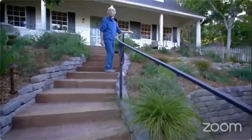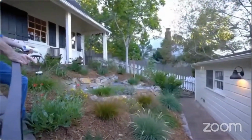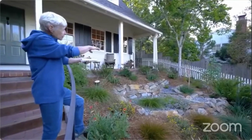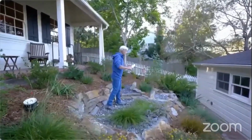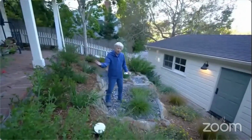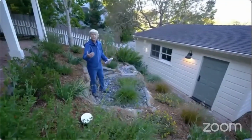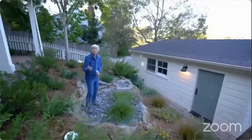So right here we have our first wetlands. And as you can see, this hillside is quite steep. So we have to be careful here because we don't want any overflow of the wetlands to come down this hillside. So what we did is we brought the water into the wetlands and capture the water back, but then as it fills, it then is set up to overflow in this direction. Rather than having it flowing down the hillside, we've broken the extreme vertical slope of the hillside to capture that water in the wetlands, which in turn raises the water level, providing water for plants once they've established.